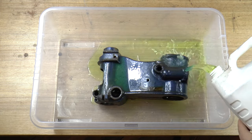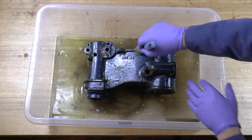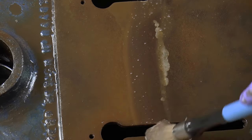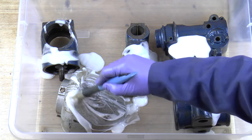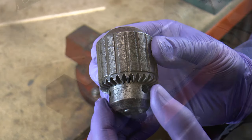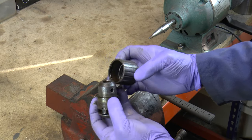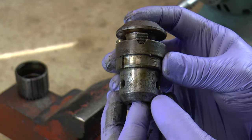To clean this dirty thing, we'll use some kerosene, which will help to loosen the old grime and stubborn grease. The base is not only very rusty but also been damaged previously, and using some filler it was fixed. This is the paint stripper — I will put it on and leave it for a few hours. In the meantime, let's take care of this poor chuck. Look how badly rusty it is. To fix it, we really need to take it apart — take all the guts off: the jaws, the split rings. One by one we'll clean it and then later we'll put it back.